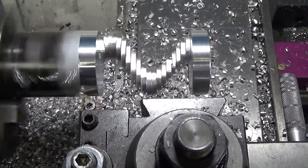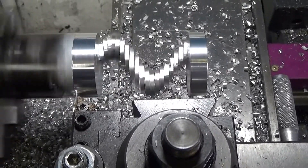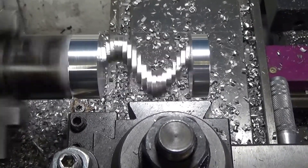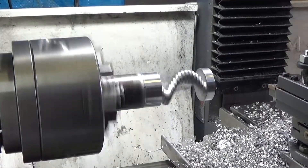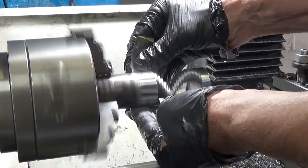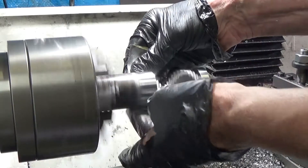I'm doing a nice clean finishing pass on what's going to be the base of the plinth, and then I'm going to knurl the base. I've found that if you get a nice smooth finish to start with, the knurl always looks better. Just a final touch up with a bit of 1200 grit emery paper to make it all nice and smooth.